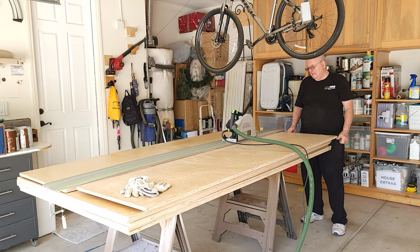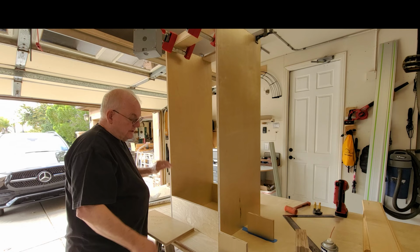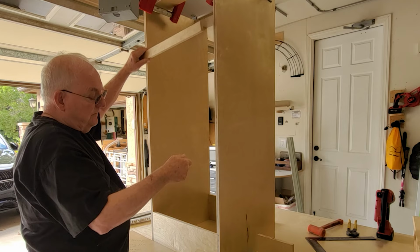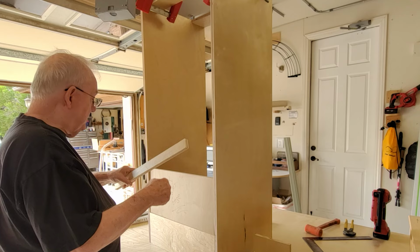So I'm probably building these a little bit unconventionally, but all my drawer slides are going on the sides, so that's going to hold all the weight. So what I'm doing is putting a face frame, kind of a skeleton here, and I'll have one here, here, and here. And I've done the whole thing in SketchUp, so I know my drawers have to be a 9-point-something apart. So I just use this drawer height gauge I made to the exact height,